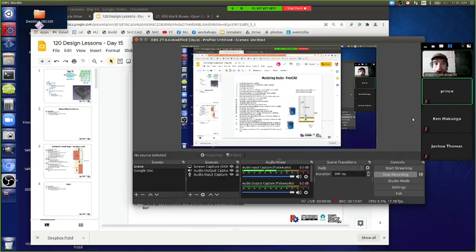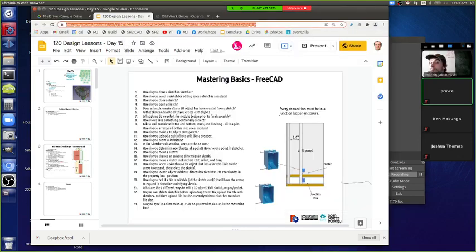So is it the same work box for the junction and the outlet? The outlet is screwed forward a little further for its faceplate. Well, actually, no, they're going to have to be different, because the old work box mounts to the surface, and the surface of the utility channel has no holes, it's closed off, because we're basically closing behind the utility channel all the wires and the junction boxes. But for an outlet, we need that to go to the outside, so the junctions are just hidden inside the wall, whereas the outlets have to penetrate to the outside so you can plug things in.